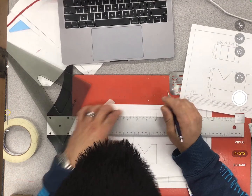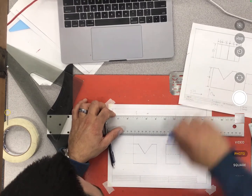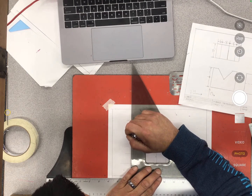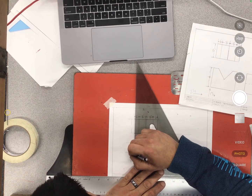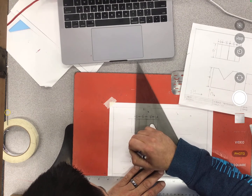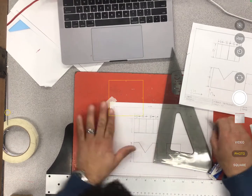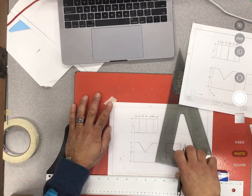Now at the 1/2 inch mark, you slide your T-square up, erase the extra. Okay, we're going to do the same thing on the side here. Draw your dimension line, like so. Put your arrowheads on. Write your measurement, 1 inch, 1 inch. Come over to your 1/2 inch mark. Erase the extra. Add your arrowheads over here, and write 1 and 1/2 inches.